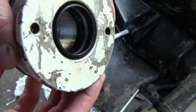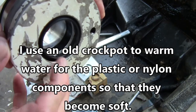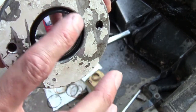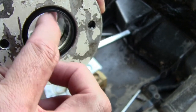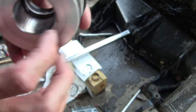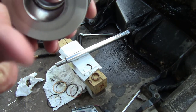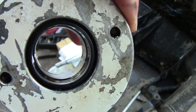After a couple trips to the crock pot, I have the seal in the cylinder head part. Seals always have a direction to them, so always pay attention to that. Every seal has a purpose — the wiper seal keeps dirt out, so the lip needs to face outward. The seal inside keeps fluid from blowing out, so the lip of that one needs to be aimed back up the cylinder. Just make sure you keep your seals oriented the right way when putting it all back together.